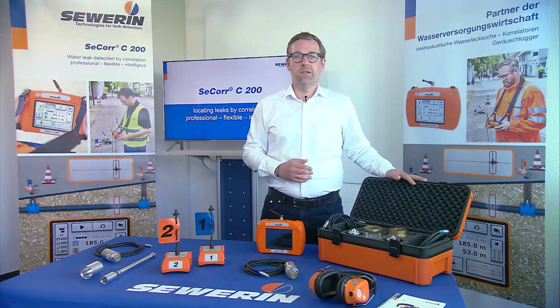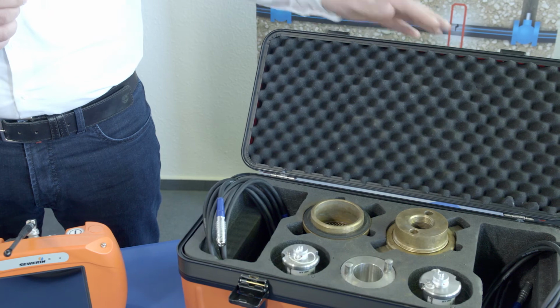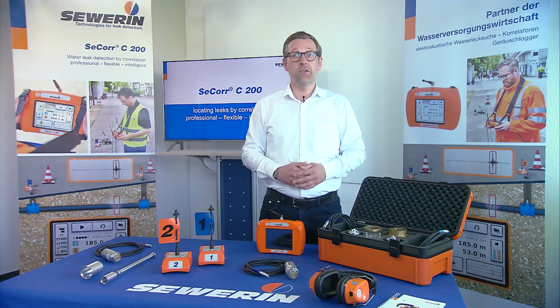Hydrophones complete the professional equipment. The HY200 was specially developed for the correlation on trunk mains. Also on plastic pipes, hydrophones often offer considerable advantages over the universal microphones UM200 in terms of the possible location distances for a measurement.